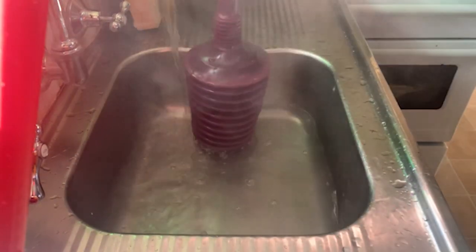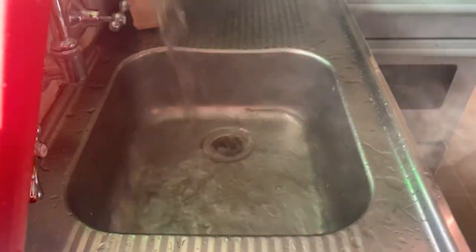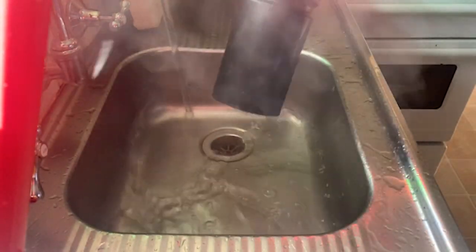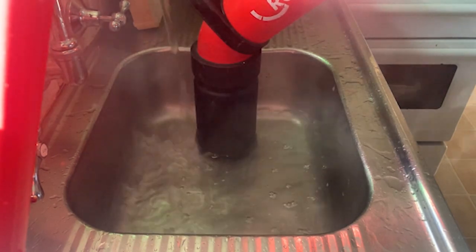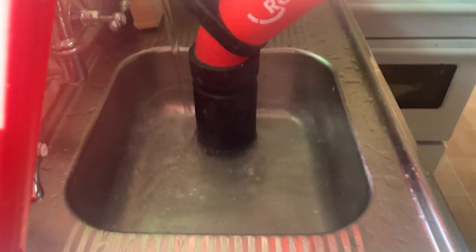Let a bit of water in and then punch it. Same as before — block the overflow hole, build up that head pressure, and you can suck up with the plunger and then drive it down. That's basically how you do all of these: shower, laundry, basin, and sink drains are all pretty much the same design.